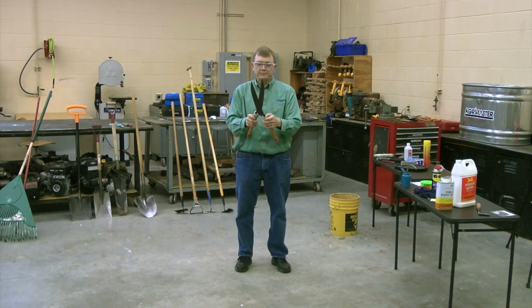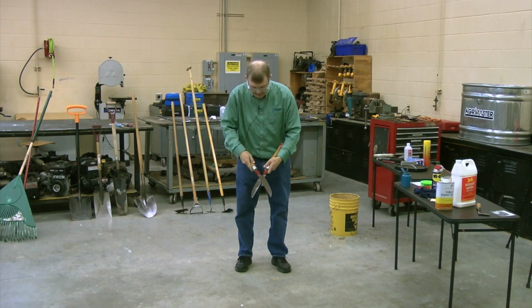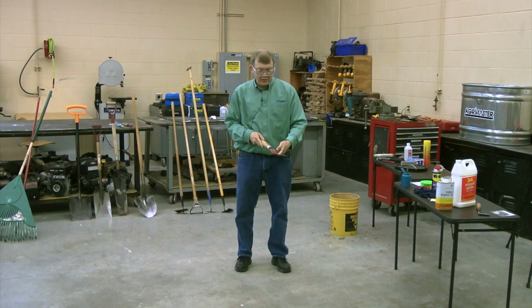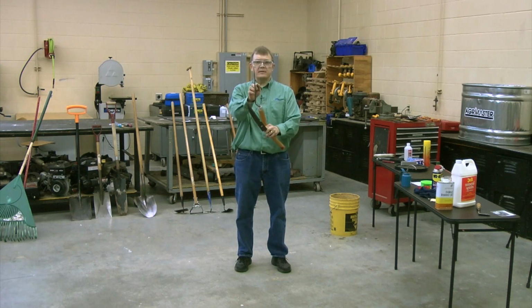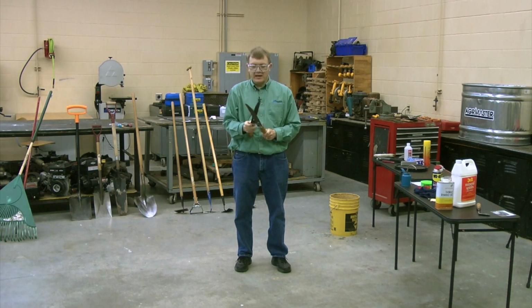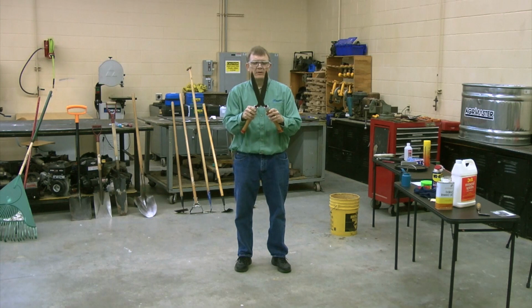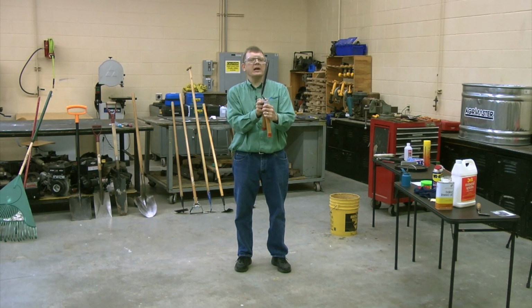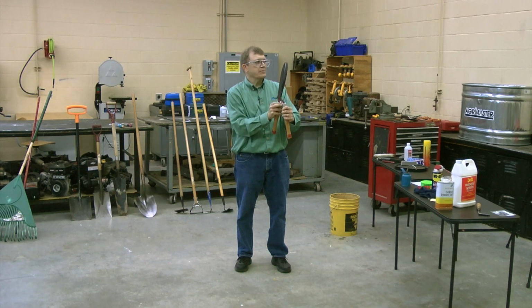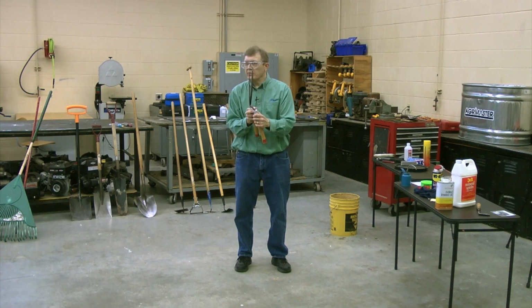That's why I pulled it out. They're supposed to go like this, right? If you use these incorrectly or over time, this bends. And if they both bend, and you've got it together and you look at it, let's get it right. You got it closed, and if you look at it, you'd see through it because it would be bent. That's most commonly what happens with head shears and why they don't work right.